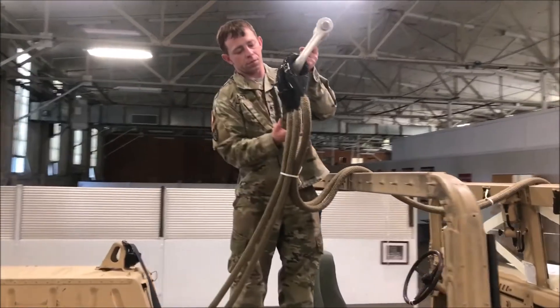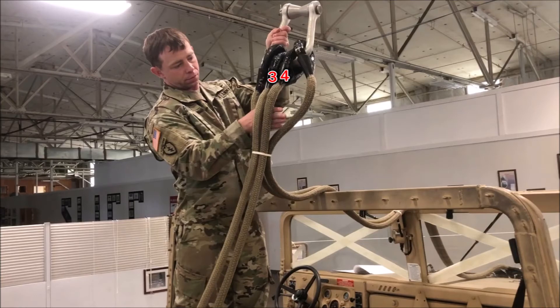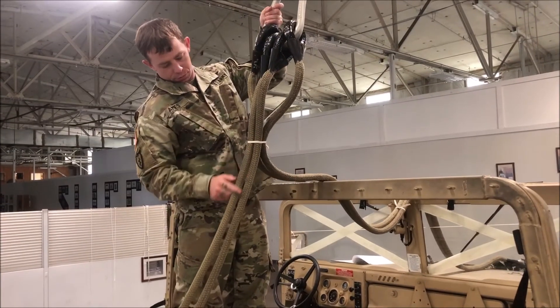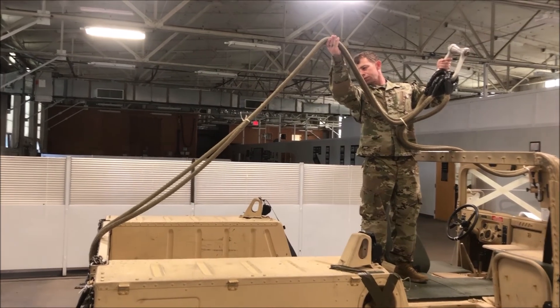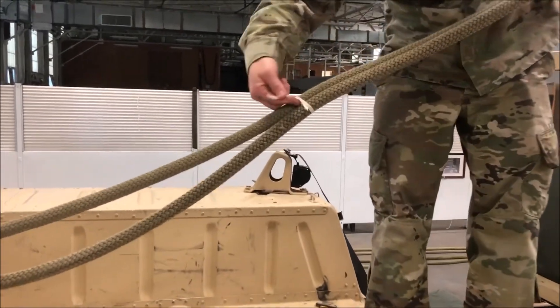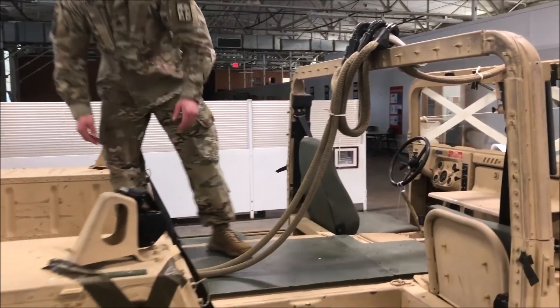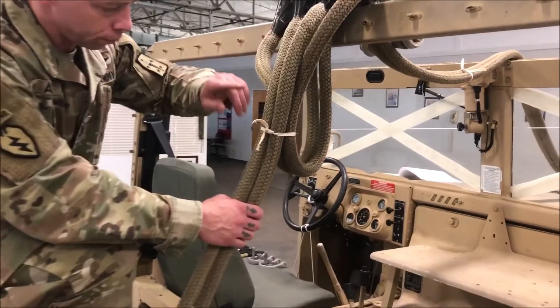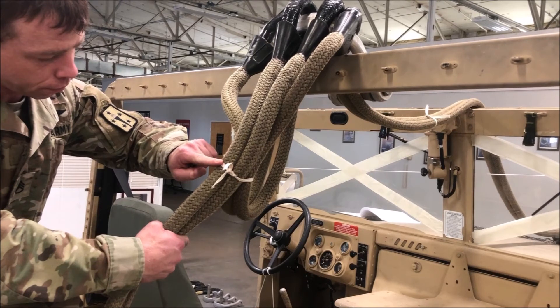Once again, hold the apex high and verify that sling legs 3 and 4 are properly routed and in the correct sequence. Trace and verify that sling legs 3 and 4 are routed free and clear to the rear of the vehicle and that they are not misrouted underneath the vehicle's roll bar. Now you are ready to inspect your fourth breakaway tie — check for proper material, that it is not double wrapped, and that it encompasses both sling legs 3 and 4. Finally, you are ready to inspect your fifth and final breakaway tie, also known as a clustering tie, checking for proper material, that it is not double wrapped, and that this time it is encompassing all 4 sling legs.